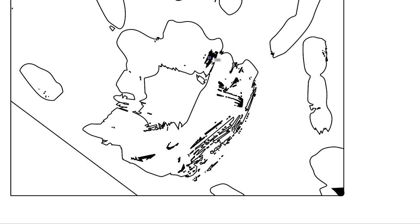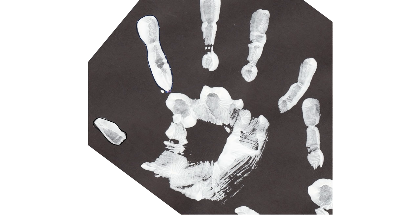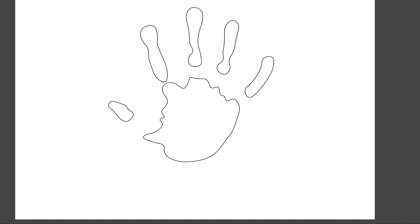I played around with having the computer convert the scan into line work, but it was taking a while to get it cleaned up enough to be usable — it was giving me too much detail. So it ended up being easier to just trace each hand and draw the line work myself. I could fix where it wasn't quite right and get smoother, bigger curves, since I can't cut anything tighter than an eighth of an inch diameter. Once I had each hand drawn, I could make the G-code to run the CNC machine from that.